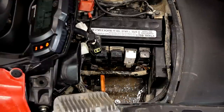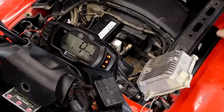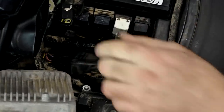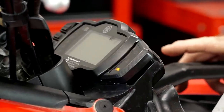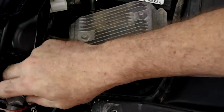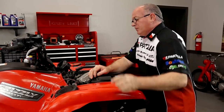I don't think there was any water intrusion in it. The connection is dry, the seal looks like it's good to go, but our display is still on. So something in there is still getting triggered. Let's just plug it back in. Actually, I want to look at the physical switch and then the associated cable that's coming back to the ECU. I think we may find something there. This also may explain why the battery was getting drained, because I'm feeling the wiring that goes from the actual switch to this connector right here, and it's actually warm. Betting there may be a problem in there.